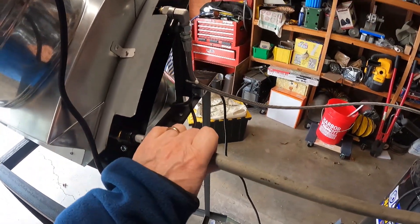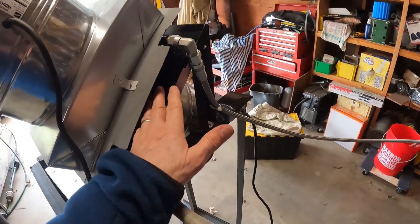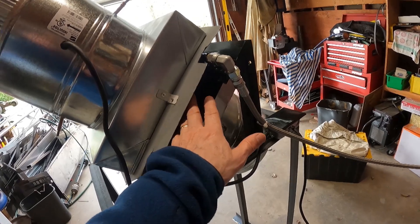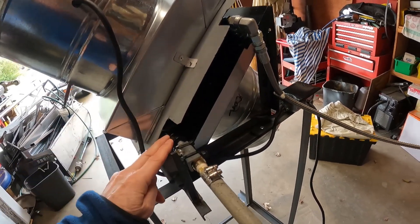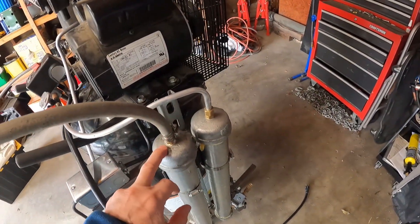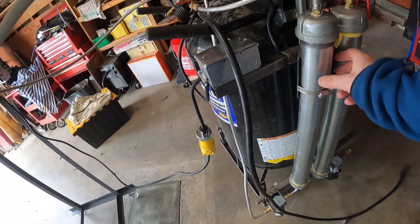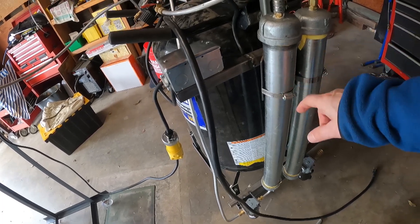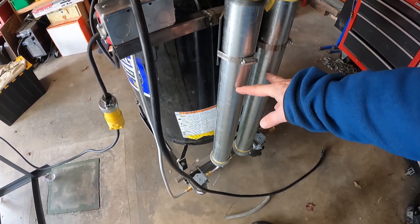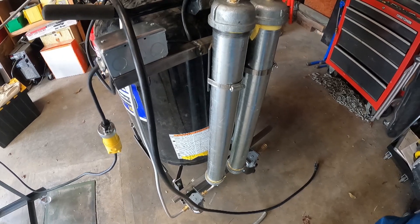We come out and again isolate the line so we don't get vibration causing stress failures. You need to orientate the cooler at 45 degrees to ensure water drains out by gravity. So we're going to be getting air and water coming down into the condenser. This condenser is a 2-inch ID galvanized steel pipe — it's important that it be galvanized because it's going to be constantly full of water and you don't want rust. Both condensers are filled with copper Brillo pads, as you can see in the picture.